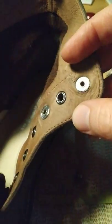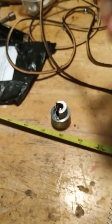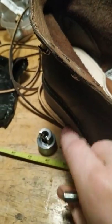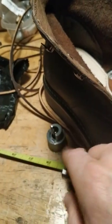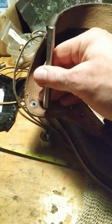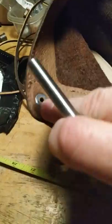I ordered the hooks themselves from China — they're actually very difficult to find — and some washers I got from Ace, and this little mini anvil. After you tear out the old eyelet and you're left with the hole, you put the grommet in, then this on the other end, and hammer it in so the grommet expands to fill the washer.